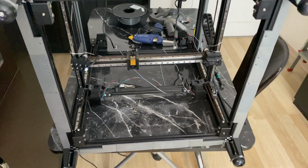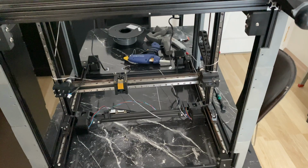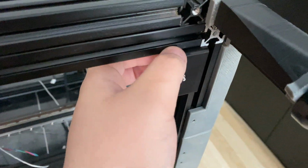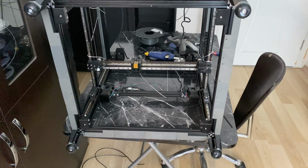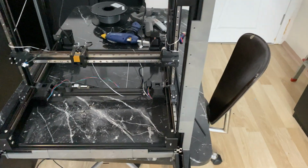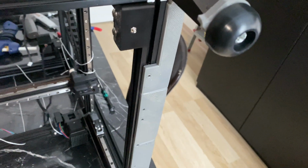So now it's time to mount the bottom deck plate. I didn't do that yet in the last episode, I just did the side panels, so it's now time to cut that. And I need to make cutouts for the Z idlers because they extend into the bottom electronics chamber. I'll cut that, stick the insulation on it, and put it here, and we'll see how it looks. And the way it stays in here, by the way, is with the skirts. Skirts are a little larger than flanges, and that's what keeps them in place. So we'll see how that goes.